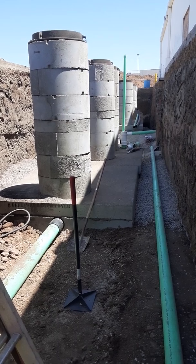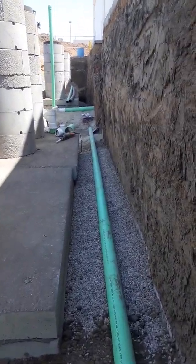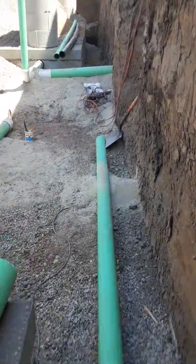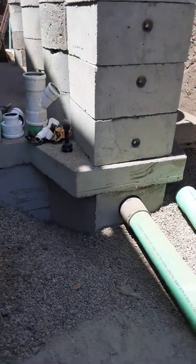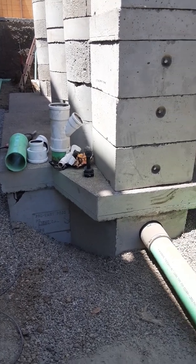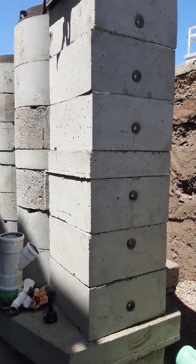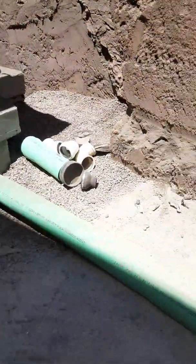As it comes out of the back end through the outlet, it ties into the main. Right here is a sewer line not going into the grease interceptor. This is our outlet of the grease interceptor — this is where the grease comes out after going through the different sections where it clears out. The grease stays and the water comes out. That's the sample box area — it has a square cover so the city or whoever can come and sample what's coming out of the grease interceptor.